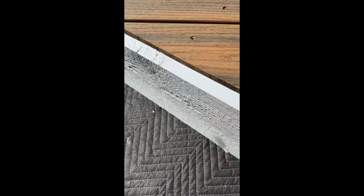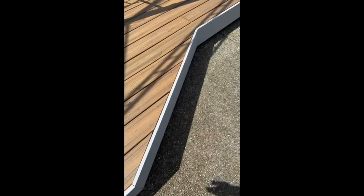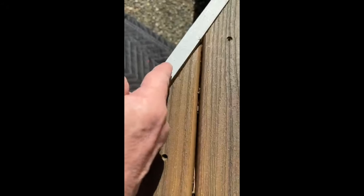That's why you get peeling problems, especially in older houses that don't have a vapor barrier. This wood should all have been back primed. I just put a coat of primer on the front of it, but I can't get behind it without tearing it off. Because the wood is not painted back there and now I've got paint on the top, there's a little edge where water can wick up underneath the paint, which could cause it to peel.